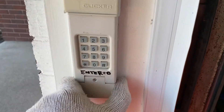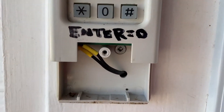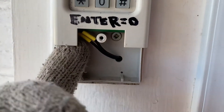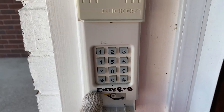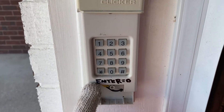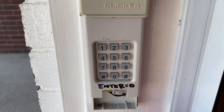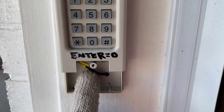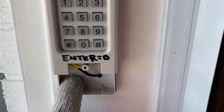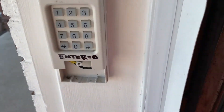Here's a hack I came up with. Take it apart, figure out where the leads are. You're gonna need some basic electrical knowledge, and if you've got questions hit me up in the comments and I can help you out. Basically, as long as you know where those leads go from the 9-volt battery that's in there originally, you wire up a 9-volt power supply.